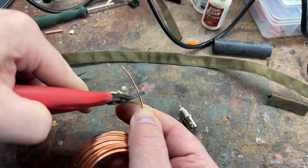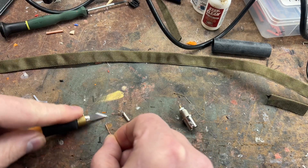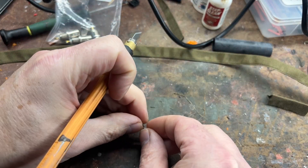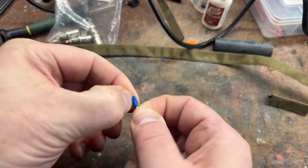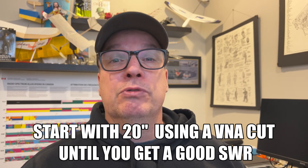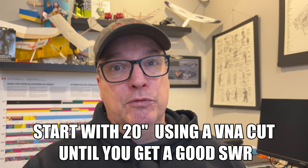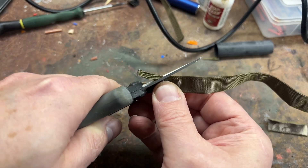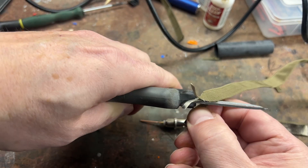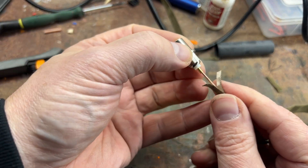What I've done is I've taken a piece of wire, made sure that the shellac is scraped off of it, and put it to the inside of the BNC pin. From there we just make sure that we have the right ferrule size to fit over the top of it. Now we've taken a chunk of the pre-sewn material for the antenna — I have about 20 inches. You can cut it down to 19, 18, 17. I honestly haven't tuned any of these; this is just a rough let's-see-if-we-can-make-something-quickly. I haven't checked it on a VNA, so take this for what it is, but the fact is it works and it works pretty good. We need to taper down the ends of the ribbon that we've sewn up so that we can fit it into the ferrule and make sure that the conductive part of the Faraday tape is in contact with the wire.